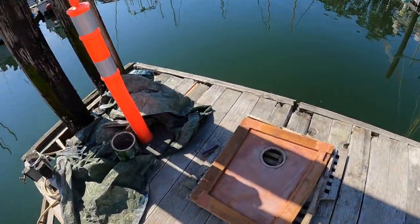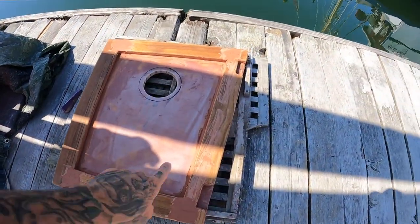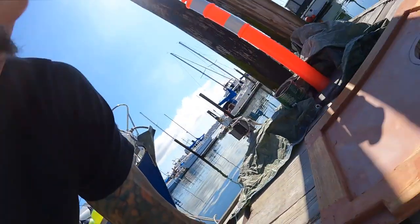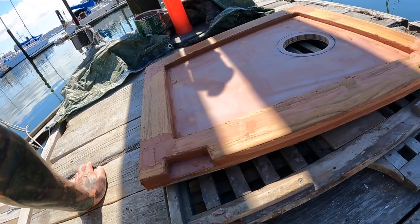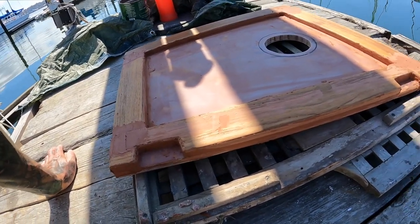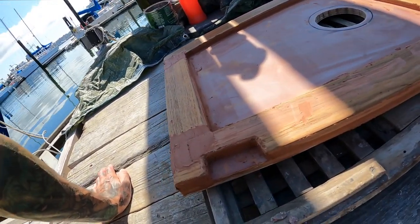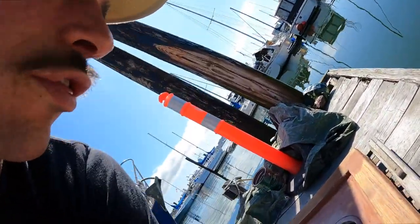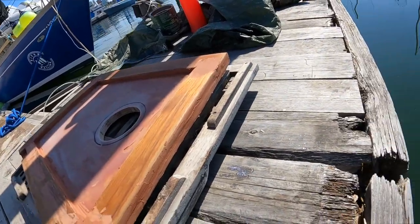All right, so we're at step 642.4. So I'll show you on this door project. I just put some wood filler in all the little voids there. It's already been glued down using thickened epoxy, West System mixed with some 403 adhesive filler. And now I just use some exterior grade wood filler. Obviously it's not the exact same color, but that's as good as I could get. It's just some little voids where there is not enough of that 403 glue, and that's going to be plenty.